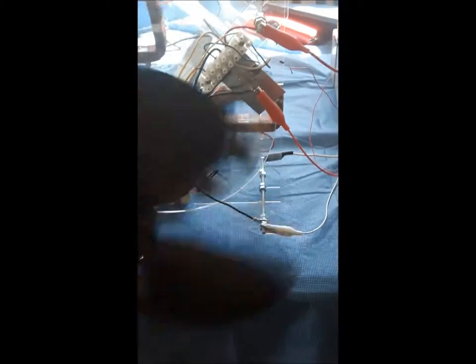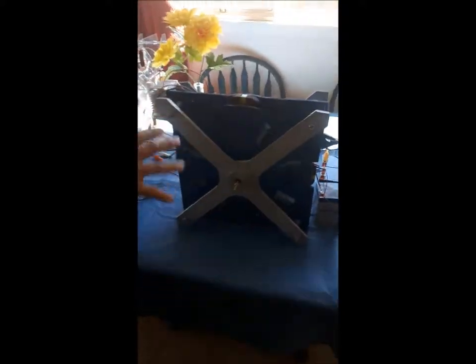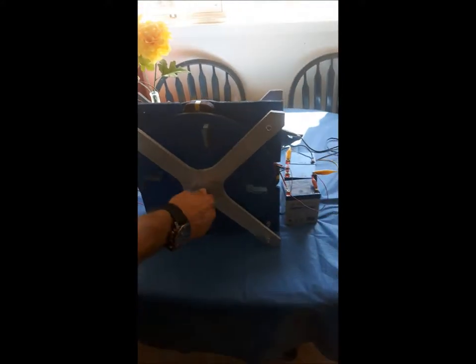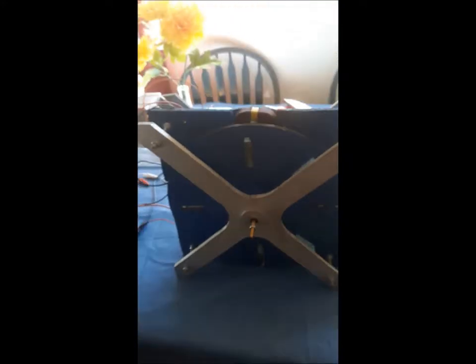In the next segment I'm going to show you a previous motor I made — very much like this, same geometry — but it has the primary coils, which are just thicker wire with fewer turns. Here it is: this is the other motor build, the same geometry. See these coils here — these are primary coils from a microwave oven transformer. Their impedance is practically zero; you can take an ohmmeter and check it — maybe 0.5 ohms resistance — so they'll draw a lot more current.